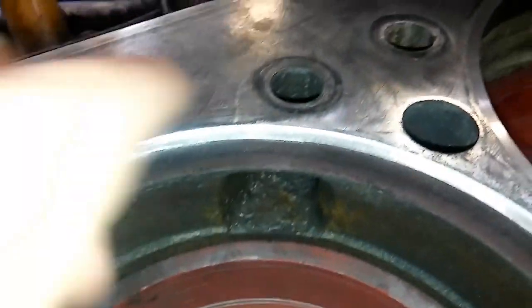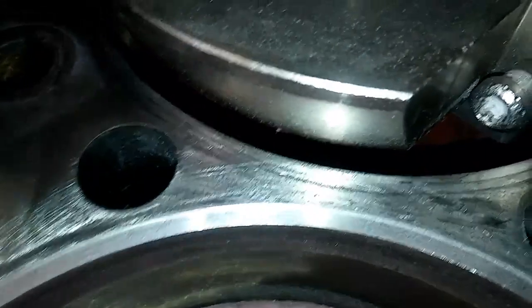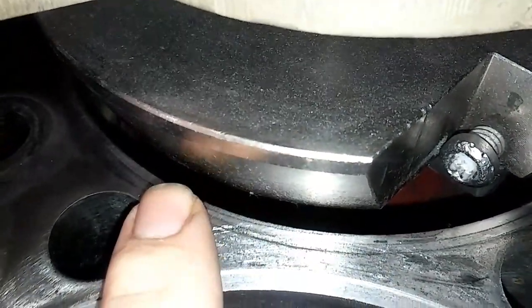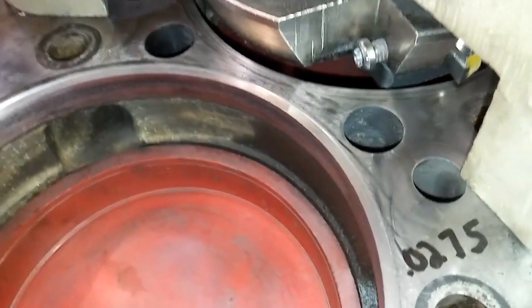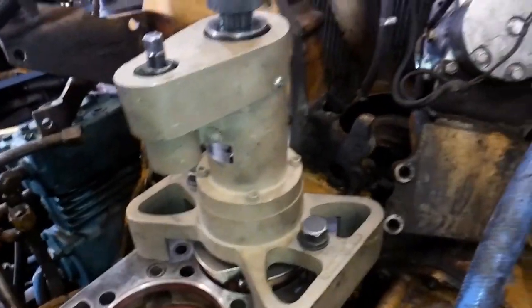Now this is the process where you're actually cutting them. You can see small metal shavings there in the coolant passage. This has not cut to depth yet. This is a pneumatic counterbore cutter — there's also a hand version that you spin by hand. We usually use both: the pneumatic one for the bigger cut, and then the last two or three thousandths with a hand cutter.